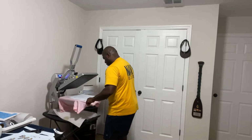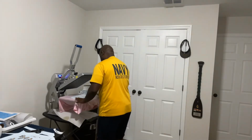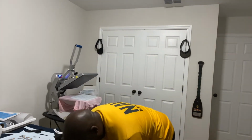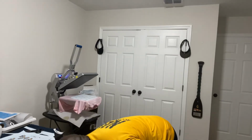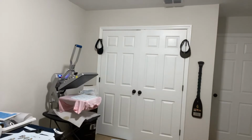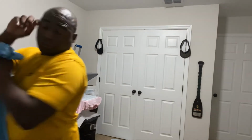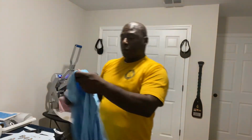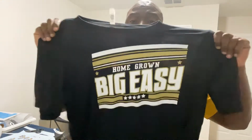Technical difficulties. For some reason, I'm not getting a good press. Don't get it wrong, this product is good. It's just time, temperature, and pressure, right? Like I spoke earlier, time, temperature, and pressure. And this is the result when you have the right time, temperature, and pressure, your product is looking like this.